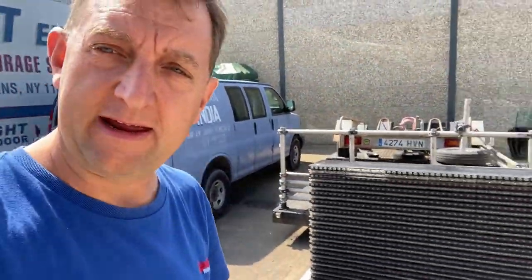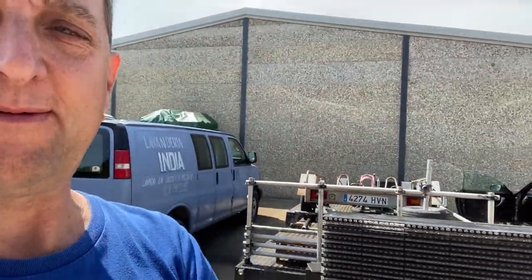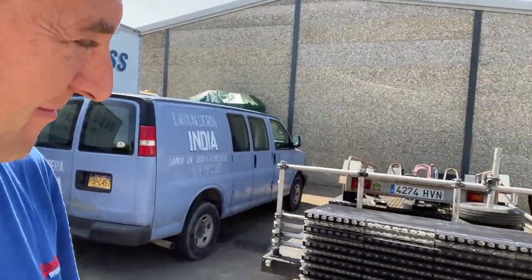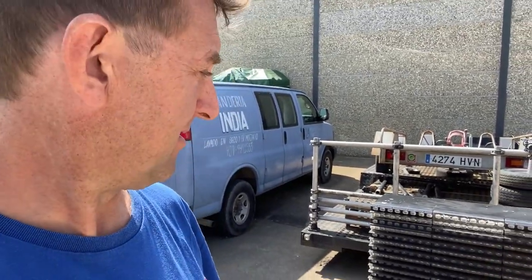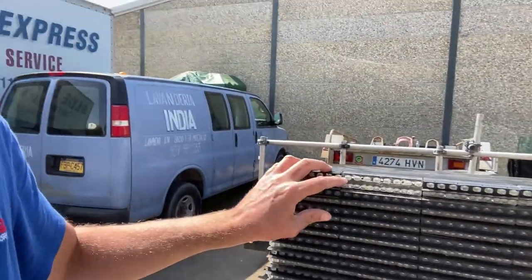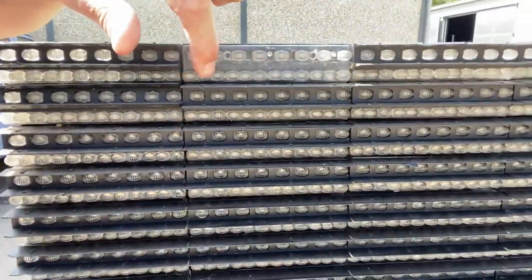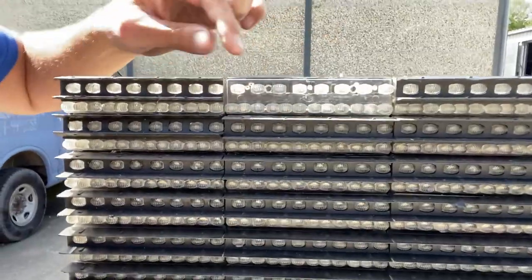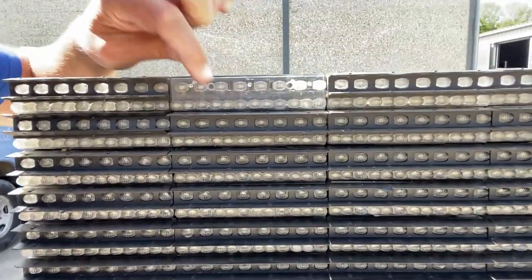This is called a DCM15 panel because allegedly it's 15 mil. It's not. That was one of the marketing tricks. It's actually a 30 millimeter panel with this 1, 2, 3, 4, 5 cluster representing one pixel, and then 1, 2, 3, 4, 5 being the very next pixel.